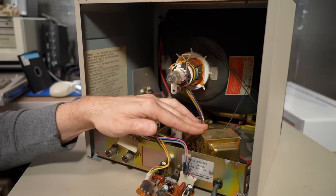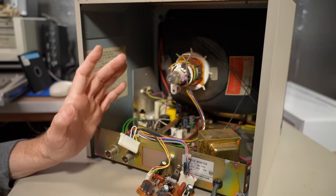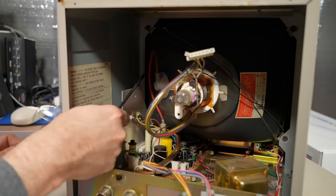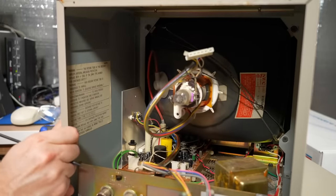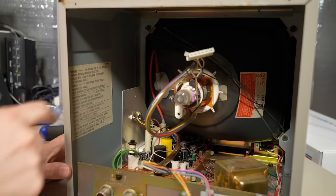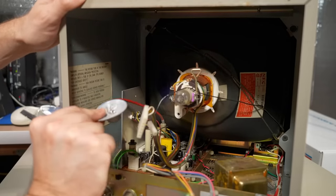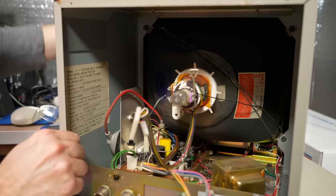This particular set uses an isolated design, so there's a giant transformer that takes the mains and converts it probably to around 18 or 14 volts, and that runs the little PCB. What's left is the high voltage anode cap — it's where the red cable goes in. We're going to have to unplug that because I need to get this cover off. I use a little plastic tool to unhook that, and now with the CRT free, let me figure out how to get this thing apart.